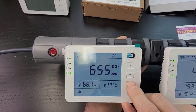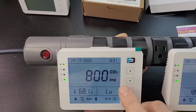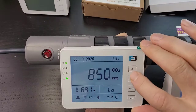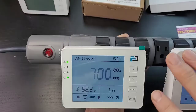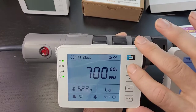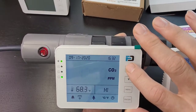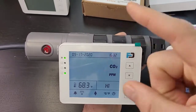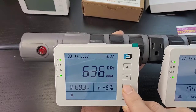Now let's go through the menu again. After calibration, 'ADV' contains your alarm levels. Enter the low alarm level — it shows 800 ppm by default. Press enter to edit; it flashes and you can change it, for example to 700 ppm, so the middle-face orange LED activates above 700. For the high alarm, go to 'high' — by default it is programmed to 1100 ppm in compliance with AB 841, California's assembly bill requiring safe CO2 levels for students at school.